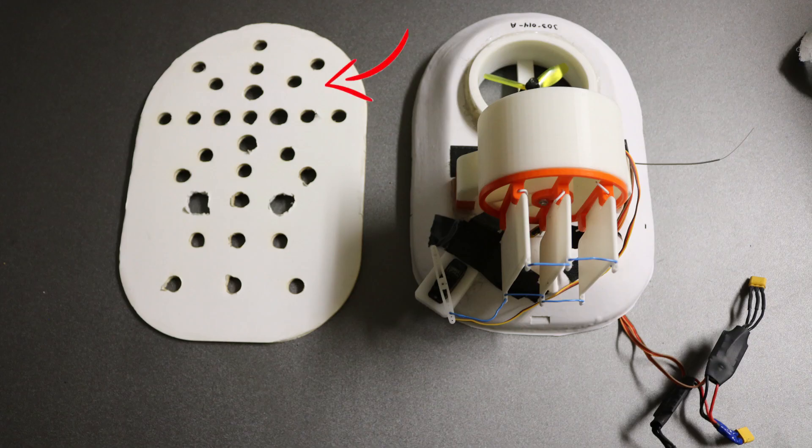The foam board was chosen as the bottom of the hovercraft, attached to the main vacuum-formed piece. A bunch of holes were cut into it, and we used a thin layer of tarp attached to the bottom over the holes. The foam board allows air to pass through the bottom into the skirt, which blows up and gives it a hover capability.